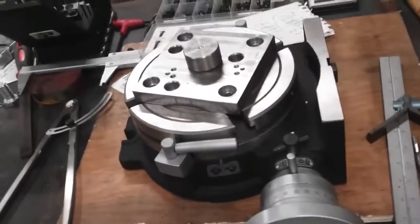Today I'm going to be showing me reworking that same part, and I'm going to use the same piece of steel and my rotary table. I'm going to throw the rotary table on the mill. I've got that piece of plate sitting on there, and I made the alignment shaft that's going to line up the rotary table itself with the adapter plate and the chuck to keep everything in center. I'm going to go ahead and rework that plate, and I'll give you a little look at that right now. After that we're going to put it on pause for a few minutes, which won't be a few minutes for you on YouTube, and jump into the next step of the process, which is going to be, of course, this rotary plate right here.